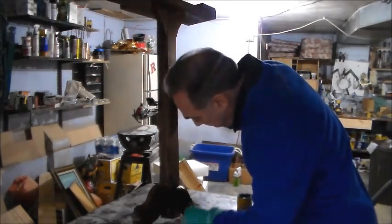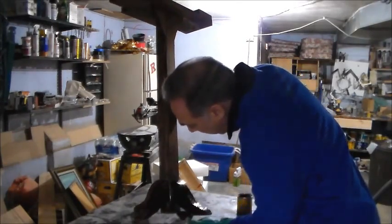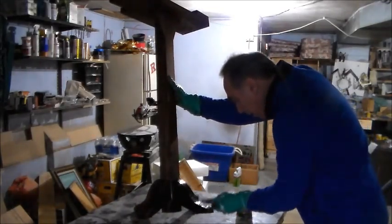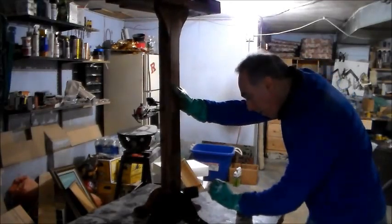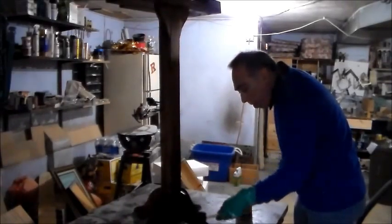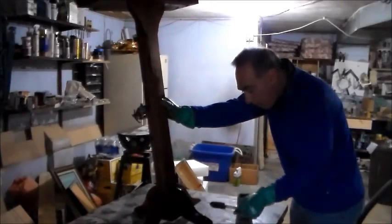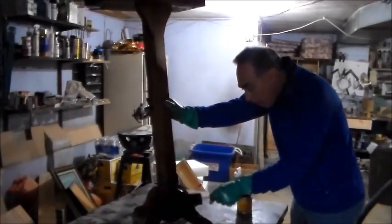I will put this coat on and leave it on longer because I want it to be as dark as I can get it to try to match that furniture. Once that's dry, I will put three coats of polyurethane on there using a gloss finish, and I will sand between coats with 220-grit. Then I'll top that off with some wax — I find that wax evens it out if you find some dull spots with the polyurethane, making the finish look a lot better.